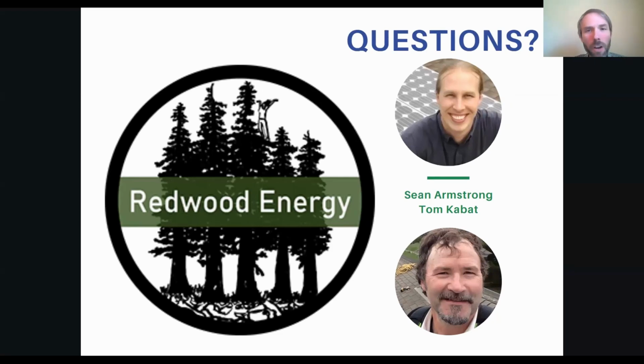So here's a question that came in: there's an interest in DC instead of AC. People claim it can be more efficient. We don't see it too often, but the question is how does that approach interact with this approach? I learned a lot from people's presentations on DC, and I've lived in a DC wired house, a demonstration house that ran on batteries off grid with a whole DC circuit. It caused real complications with plugging the wrong device into the wrong outlet, which blew up an inverter. Really expensive to have hybrid wiring.